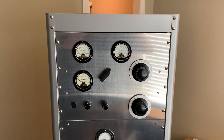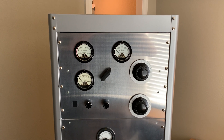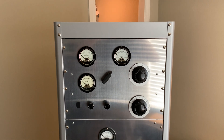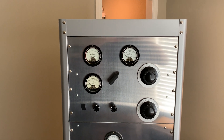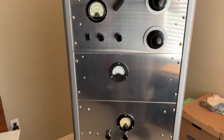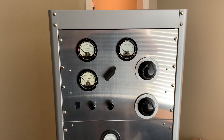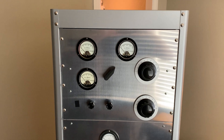This is W5HRO. Here's the AM homebrew transmitter I built back in the early 90s. I started gathering parts in the mid to late 80s and had it assembled and ready to go by around 92-93. This is the one that used to be broad as a barn because the negative peak when I modulated would go way too far negative, so I could never turn the speech amplifier up too far. I had to keep it turned down to keep it from splattering - it was like 20 kc's wide. But it sounded beautiful.